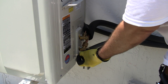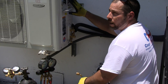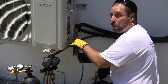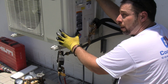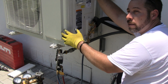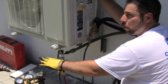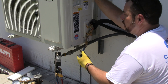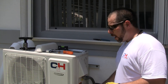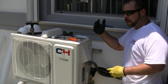Now we're ready for the high-pressure leak test. These systems come pre-charged from the factory with refrigerant — the exact weight is marked on the side panel. Before opening the lines, do a high-pressure nitrogen leak test and let it sit for a few minutes to verify all connections are good. If you're installing this yourself, call a licensed HVAC technician at this step to perform the leak test and then vacuum the system to evacuate any impurities. Once the vacuum is verified and holding, go ahead and open the valves to release the gas from the condenser and flow it through the system.